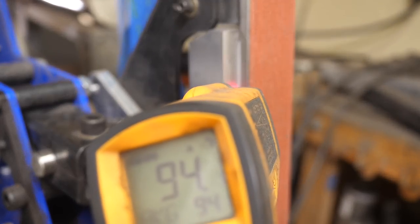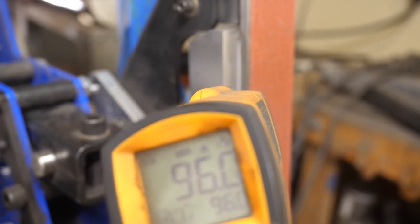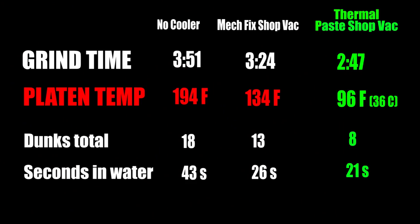Guys, I do not deceive you. That is a 96 degree platen temperature. So let's compare: 2 minutes and 47 seconds grind time, 96 degrees Fahrenheit, only 8 dunks in water, 21 seconds total in water when I review the tape.